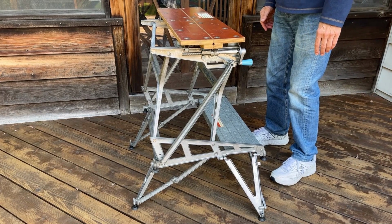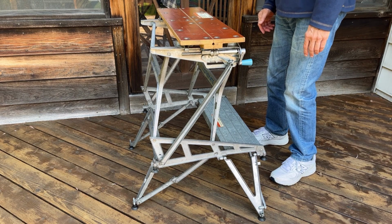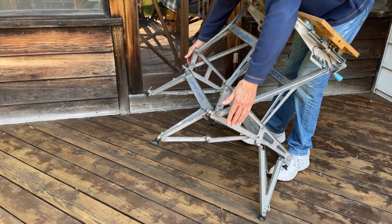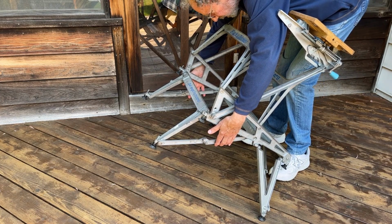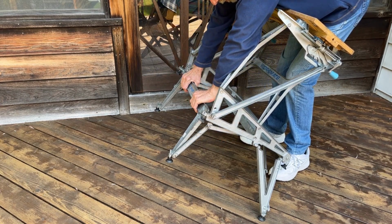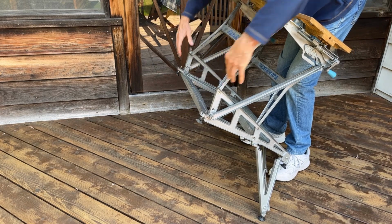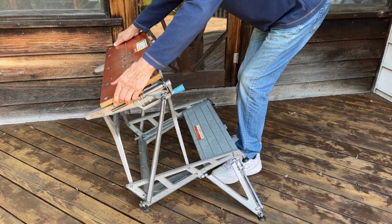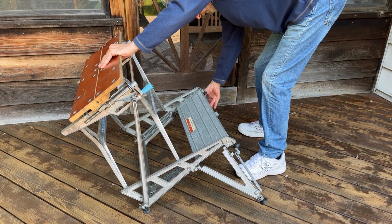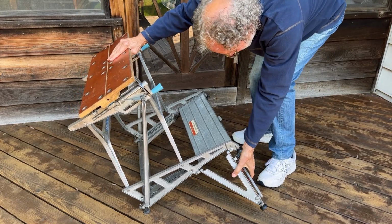With the Workmate upright in its full bench height, if you want to fold it, you start by tipping it forward while you're standing in front of the front step. Reach down to the struts that hold the rear leg assembly out. You start to fold them, trying hard not to pinch your fingers. Grab hold of the rear leg assembly like this with both hands. Twist those legs underneath the frame. Set the rear end of the frame down on the ground. Then fold each of the front legs in sideways underneath the front step, starting by releasing the struts.